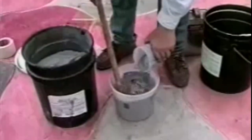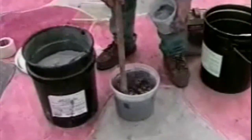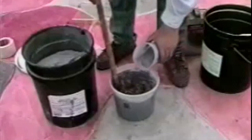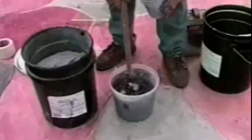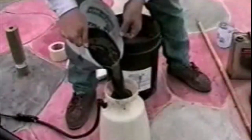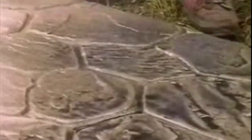The antiquing effect, normally obtained through the use of release powder, is done here by mixing one part of solvent-based concrete sealer with one part of xylene, then adding powdered release agent into the mixture until the desired color is obtained. The day after the stamping, the antiquing mixture is liberally sprayed onto the surface and allowed to dry. If the surface area is to be highlighted to a greater degree, use a Camelback sponge to brush xylene lightly over the top to remove excess coloration after the surface has dried and prior to sealing.